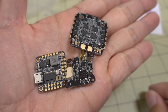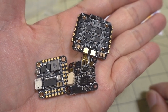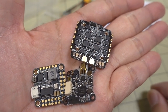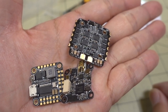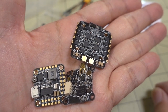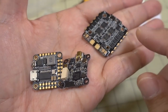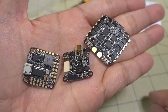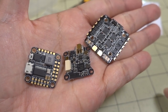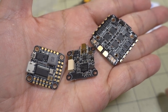This stack is pretty versatile — you could use it in a lot of different builds, from a 3-inch all the way up to maybe an ultralight 5-inch. 35 amps is a bit on the low side for 5-inch, but with light 2204 or 2205 motors on an ultralight 5-inch it could work as long as you keep the weight down. The flight controller and video transmitter are solid, and having 5 UARTs on an F4 board is a nice touch. If you have any questions, let me know.